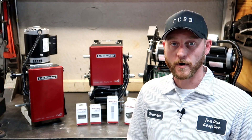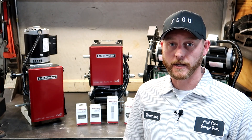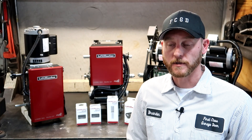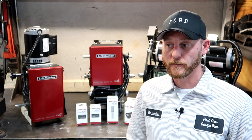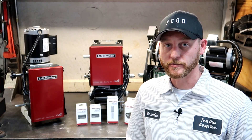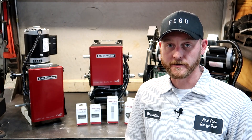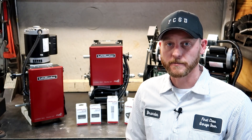Your other option is buying all new remote controls and having them all reprogrammed. The better alternative — and we'll do a video on it at a later date and put a link in the description — is that an external receiver would be a much better way to go. They're less likely to have problems in the event of a power surge. We could also duplicate the memory depending on the model of external receiver. So if there is an issue and the operator needs to be replaced, repaired, or whatever, we can just disconnect the receiver and reconnect it to the new or repaired operator. Just something to keep in mind.